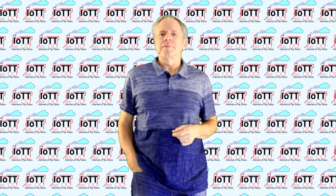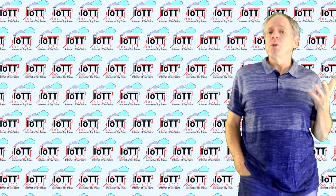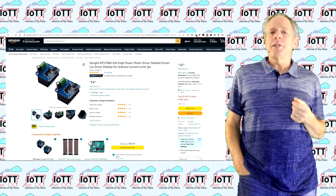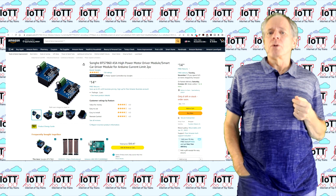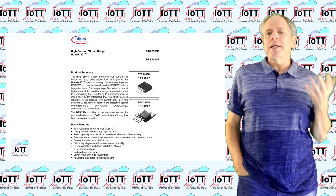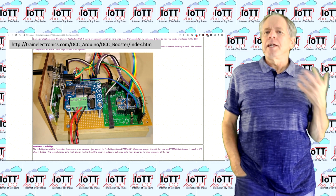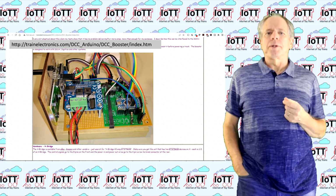I am Hans Tanner. For my tests, I used two different IBT-2 modules, both available on Amazon for little money. The first is what probably can be called the standard IBT-2 module, as this is the one you get pointed to first when doing a Google search. It is based on the BTS7960 chips for a maximum current of 43 amps. It is the module that many of us know from the DIY booster design David Botner did a few years ago, which I reviewed in video number 34.